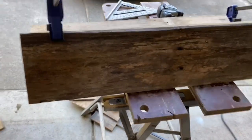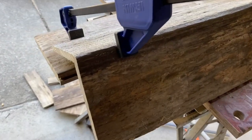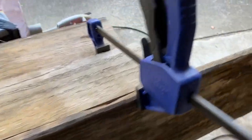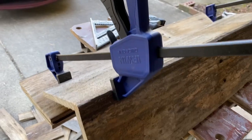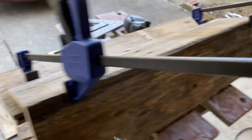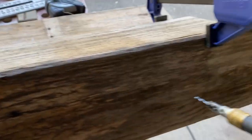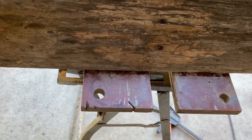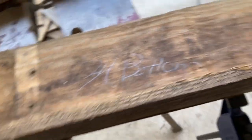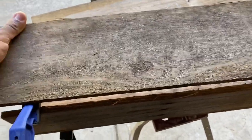I'm also using a handful of clamps. I start with my 34-inch bottom and a 27-inch side, put two clamps on it to hold it in place, then pre-drill wherever I want my screws — three per side: one at the front, one in the middle, and one at the back. Once that's drilled, I screw it together with my hardware. Then I take the clamps off, do the other side, and put another side plate on it. After that side plate is screwed in place, I grab a top plate and do the same process.